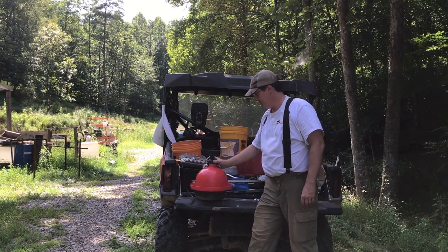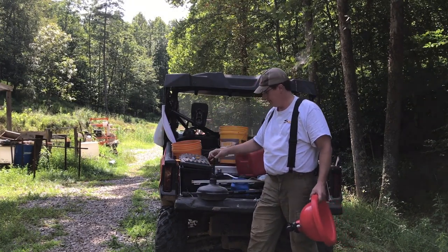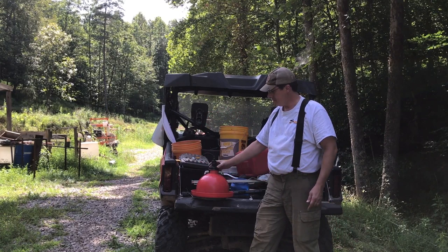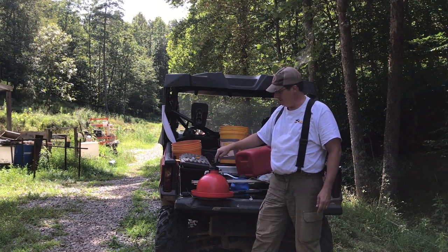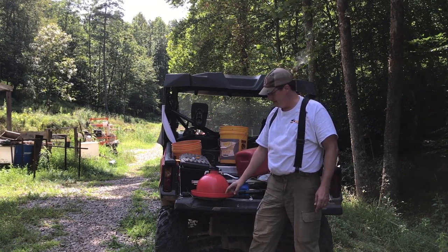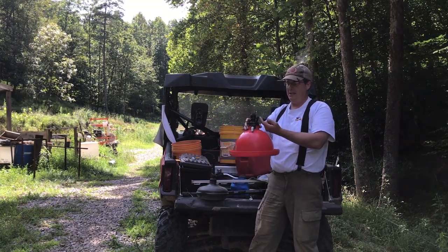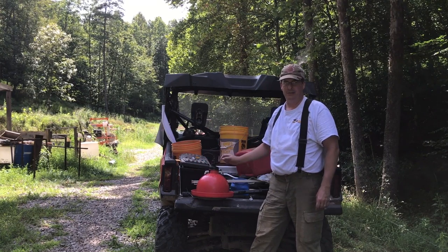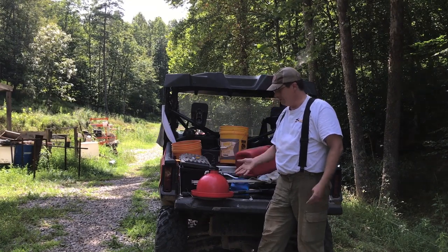For those who don't know, it's a simple concept. This is a weighted ballast — it's actually just full of water — with a hook so you hang it from something; it has to be suspended. The bell slides over the top; there's a spring inside. Water feeds in through the hose, cascades down the outside of the bell, and fills the trough. As the trough fills it gets heavier, and that weight brings it down and shuts off the water — basically a reverse toilet, weight down instead of a float up.